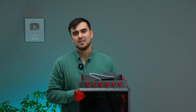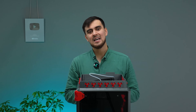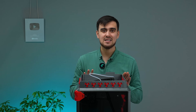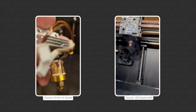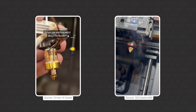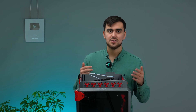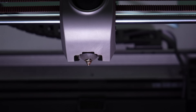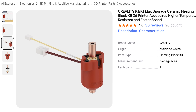One more problem from the Creality hotend — quick note, I haven't had this problem yet, but the community is reporting that the ceramic heater is breaking off mid-print, with inconsistent temperature readings resulting in self-burning while printing. Creality has newly designed a hotend to address these issues. The old one has a black sock, which I have, but the newly designed ones have a red sock so you can distinguish them. We should change to the new one as soon as possible.